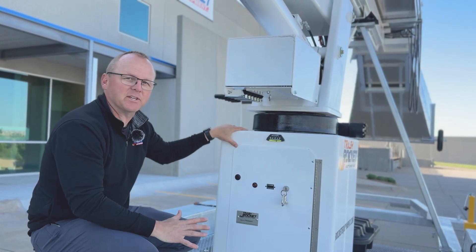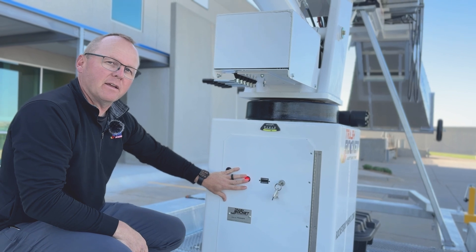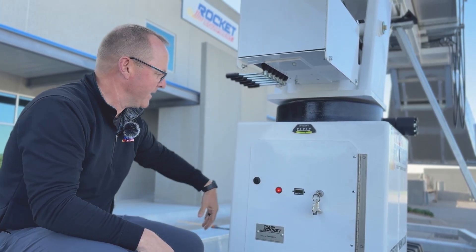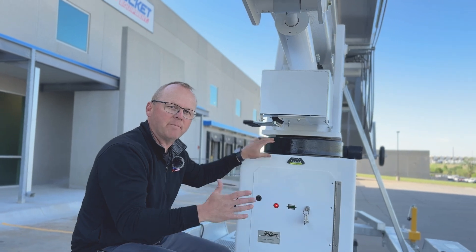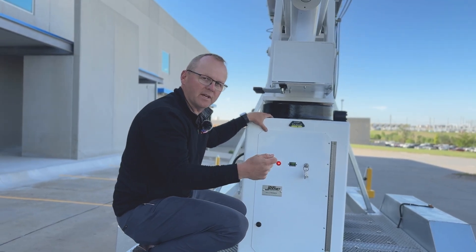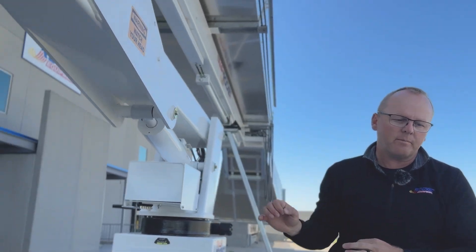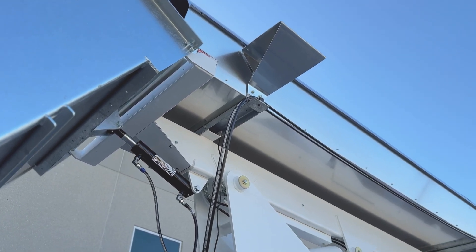As far as how the rocket is powered, there's an ignition switch on the tower. You'll turn that on, which sends the battery power to the hydraulics inside. There are two deep cycle batteries, which makes this very low maintenance. There's a battery charger that you can plug in using a regular 110 extension cord. You'll get about 90 minutes of run time on a full charge, and you'll know your battery life with the battery indicator light so your crews know if they need to plug it in on the job site. We've also incorporated a small solar panel up on the chute with a drip trickle charge to the batteries, so if it's parked outside and not being used, it'll maintain the battery life for you.